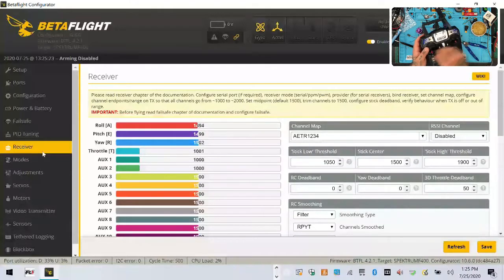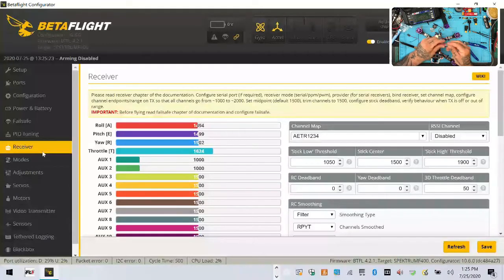Go to receiver — there we go, everything is dialed in perfectly. He sent me the pieces so I'll screw those on. We have iBus functioning on this SP MFC F400. I was seeing people say they had a hard time getting iBus — or S.Bus — to work on this board. S.Bus is inverted, but regardless, it is working now. I just need to get this tape off my hands.